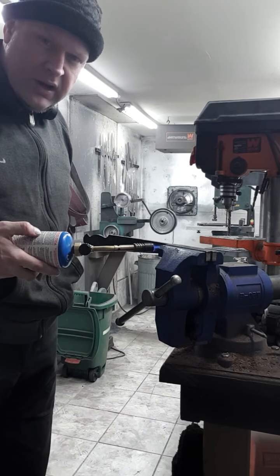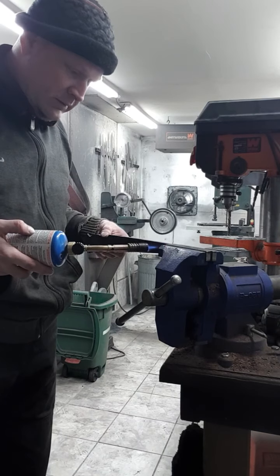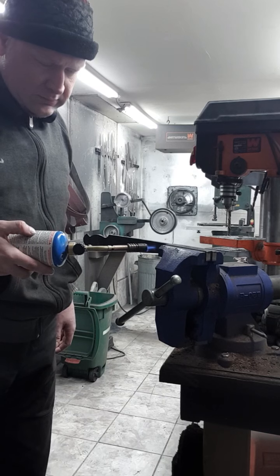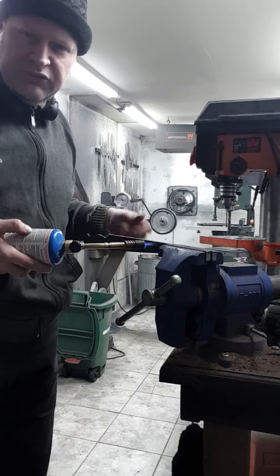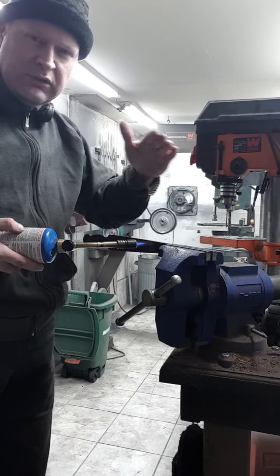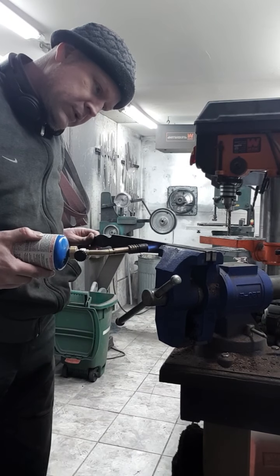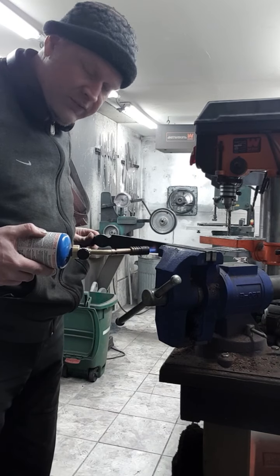The torch is not hot enough. This is a big, thick piece of steel too. It looks like 5/16. So there's no worries of taking the temper out. If you truly want to anneal a piece of steel, that takes many, many hours and slowly taking it down from critical. So there's no worries of anything. So don't worry when they get warped. It's not a big deal.